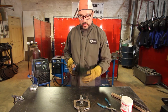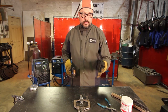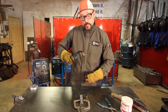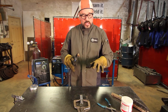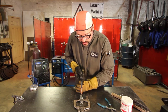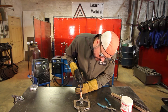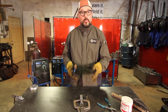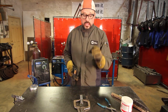What we want to do is establish the movement. A couple of recommendations: first, don't move your support hand too much. You don't want to get into the Popeye with the opposite hand, you don't want to get into the chicken dance, and don't go up into your elbow and shoulder. You want to use the smaller joints. If you want to use your wrist, rest your hands down, don't add your weight. When you pull the trigger, develop the puddle, then just move back and forth rolling your wrists as you go, pulling the puddle through. It's all about the puddle — you've got to keep that puddle the same size the entire time while you are executing your control.